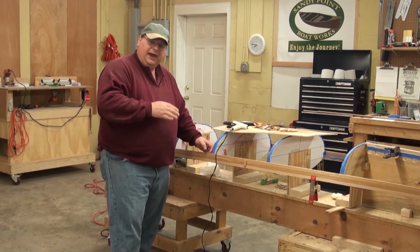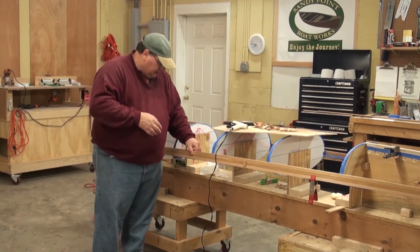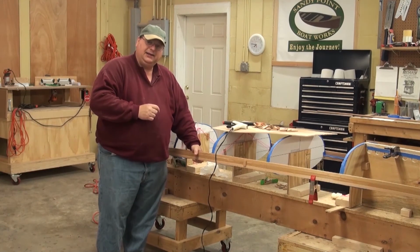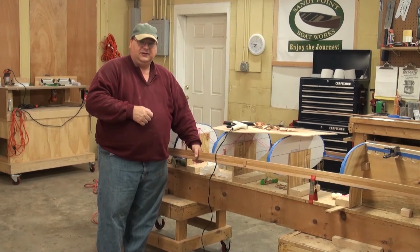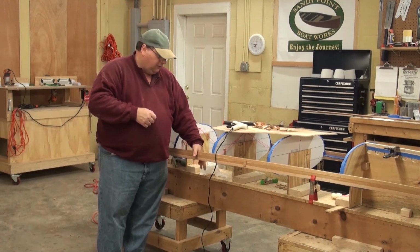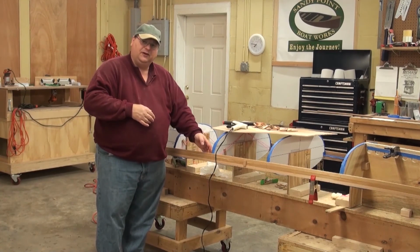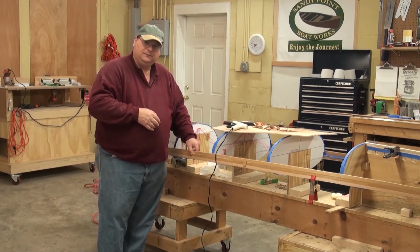Never, ever walk away from the boat without checking all the strips that you just put in, making sure all the beads and coves are together. Because if they're not together and it's askew one way or the other and that glue dries, it's just such a big pain in the neck, right? So never walk away from the boat. The final thing you do is wipe it all down, get rid of all the excess glue, and make sure every bead is inside of every cove. All right.